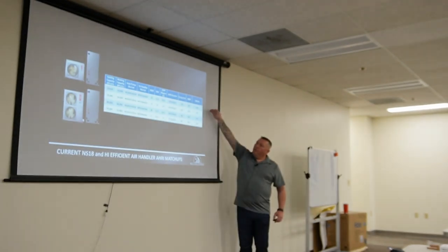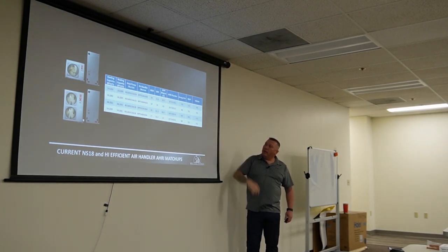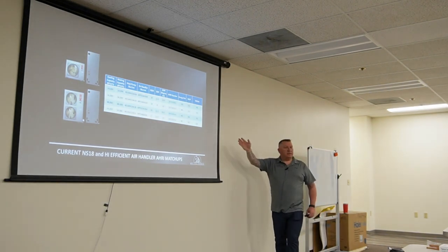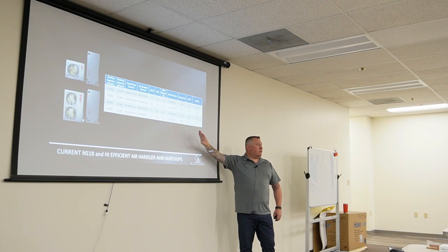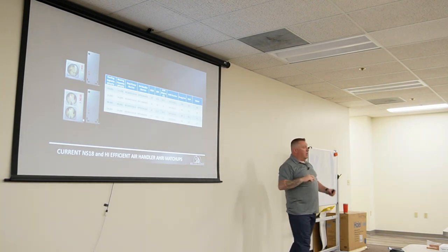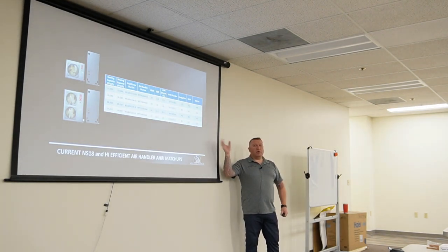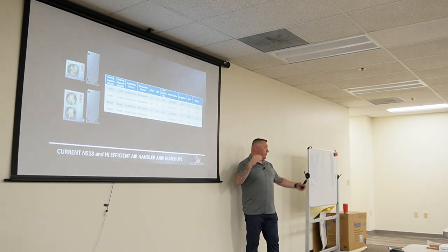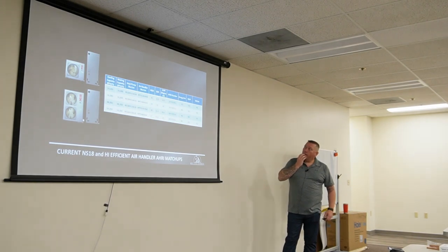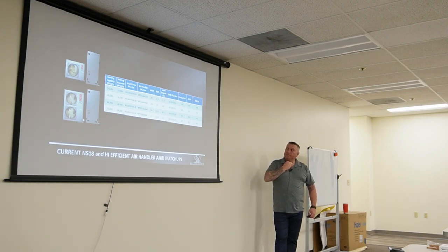Units come in 24, 36, 48, and 60 — the 60 is actually 54. They are all SEER2, Energy Star rated, and NEEP rated, with AHRI numbers. AHRI numbers change frequently so don't take the slides as final. We're also coming out with SKUs so the heat pump and a coil can be matched with any furnace, giving a whole new AHRI combination number. All SEER2 units are completely Energy Star certified across all capacities.